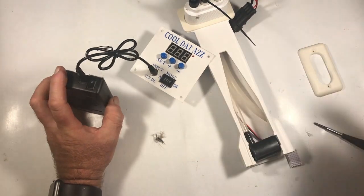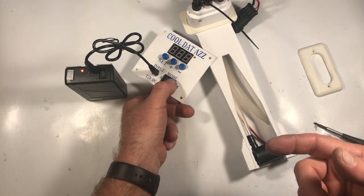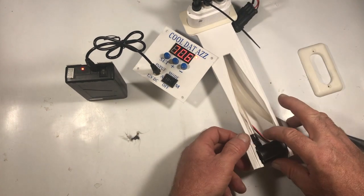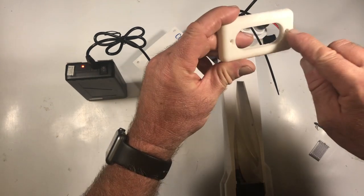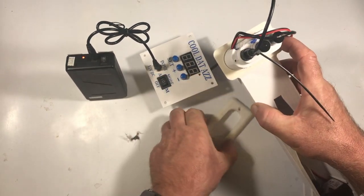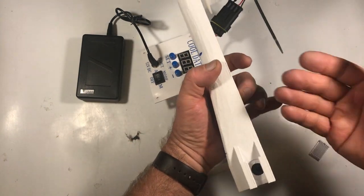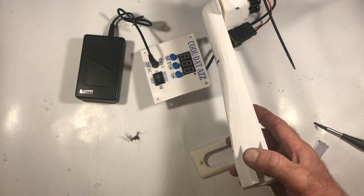So I'm going to fire this thing up, and I would almost bet money it's going to work now. We'll turn it on manual mode first. Sure enough, we got the dead cat out of there, and the pump works like a charm now, both modes. Of course, when you're putting these back on the cooler, the main thing to know is you don't want to over tighten these screws, because this is plastic here, and you can strip it out if you tighten the screws down too much. Other than that, it's a pretty simple process. Somebody might get intimidated by it, but once you have this out of the cooler, it's a very, very simple process to clean it.